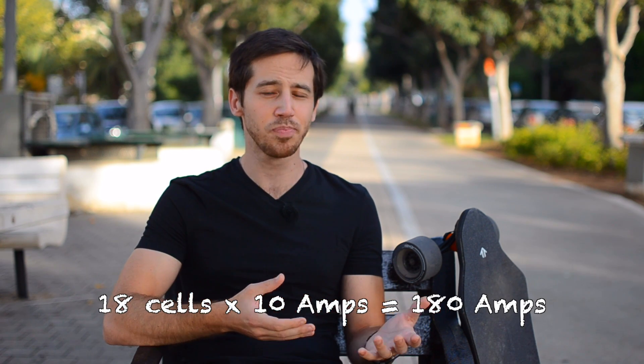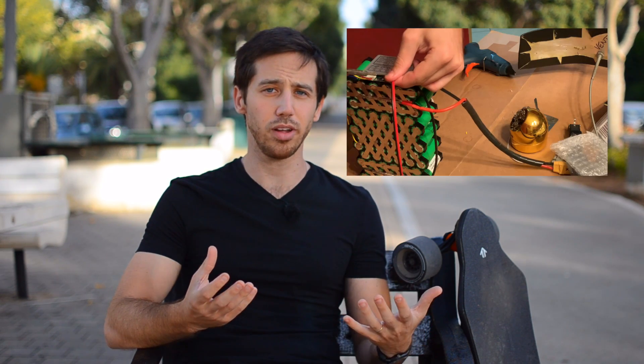The next question was: how did I make sure the battery could support enough current? The battery I built had 18 cells in parallel — these were LG MJ1 cells. Each cell is capable of supporting 10 amps, so theoretically the battery can support 180 amps. I like to say you should cut the max current of the battery cell in half to get to a safe level, so we can call that about 90 amps max. You've also got other limitations besides the cells — for example, the 12-gauge wire I'm using is not going to support 90 amps continuous. But the good news is I'm not pushing it that high. The motor on this kayak is only pulling a maximum of 25 amps, so with wire that can support around 50 amps and cells that can support 90 amps, I've got a significant safety factor and don't have to worry about getting close to the current limit.